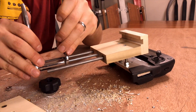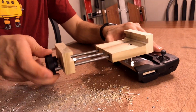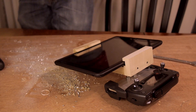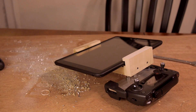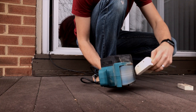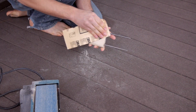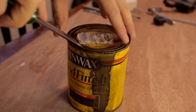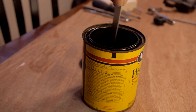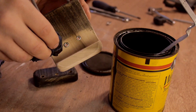The way the screw in the mechanism works is that there are nuts on both sides of the sliding block. When you turn the knob it moves that block in and out by progressing the screw in and out of the clamp. I don't stain things often because it ends up being a lot more work than using something like tung oil or Danish oil, but for this case I wanted it to be black.